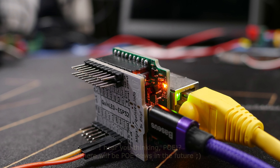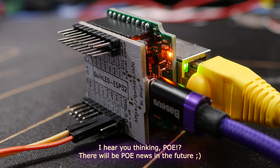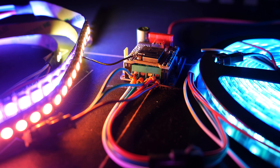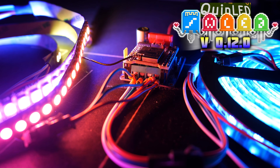Need a board you can power using USB-C, connect to ethernet and run a few sensors? This is it. So let's move on to the actual digital LED controller boards. The main change there is that the ESP8266 option for the QuinLED Dig Uno pre-assembled is going to go away. With producing the custom ESP32 board in-house, and leaving off the temperature sensor of the Dig Uno which most people weren't using, we can offer the Dig Uno with an ESP32 by default now, with only a slight price bump. Next to all the advantages this has because the ESP32 is much more powerful, this also means the board is instantly transformed into a dual-channel LED controller. Especially with the new WLED 0.12, this is very quick and easy to configure from the GUI, and makes the board even more versatile than it already was.